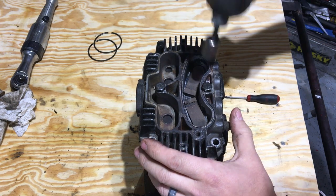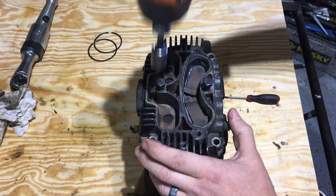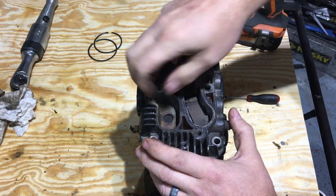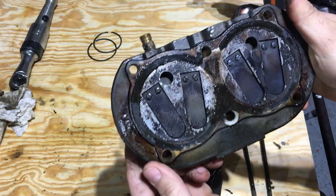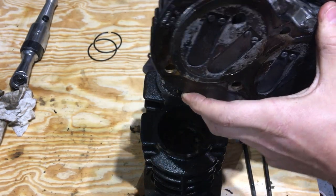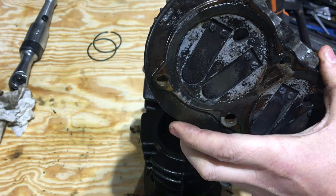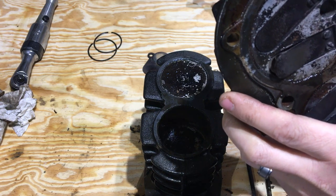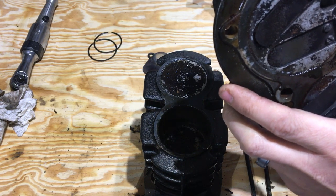We can go in deeper and see the actual pistons traveling up and down. When we pull the actual head off — there we go — you can see those valves there, and I can push and move those valves, those little reed valves. Some people will actually rebuild these valves. There are actually a little bit different spring rates on them. This will allow air to get drawn in.